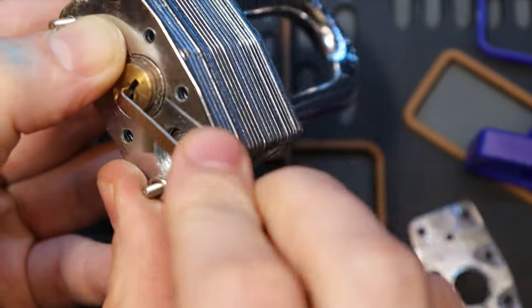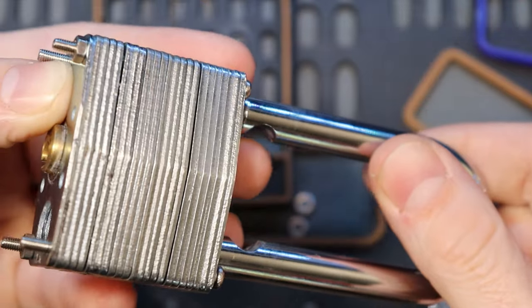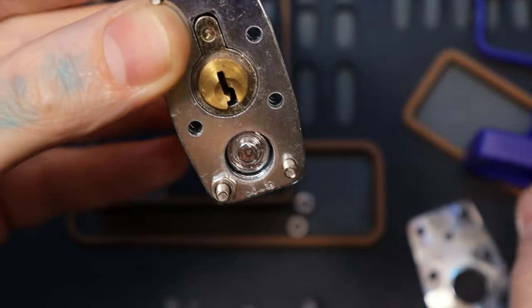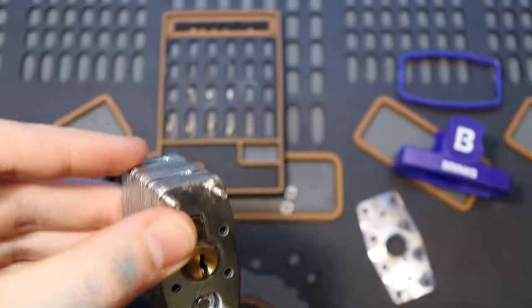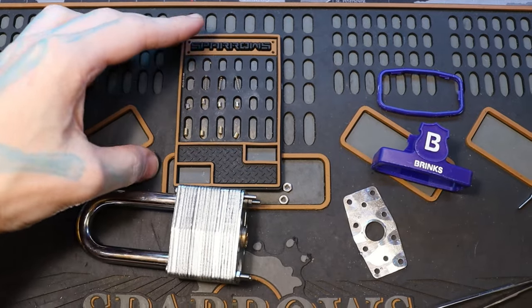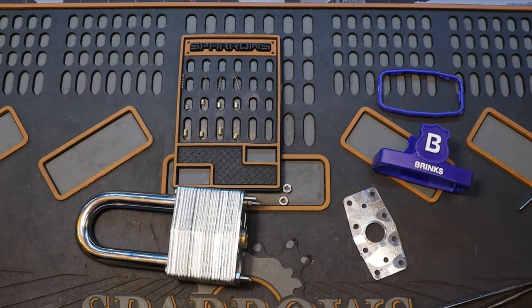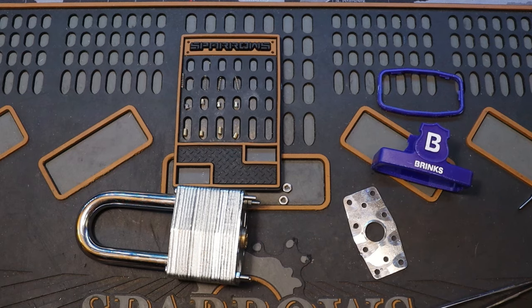There we go, now it's all the way back. We turn it and that releases our ball bearings. I shut it and it goes back. Really cool, really interesting to play with. I have not taken apart a laminate lock before. I think I might be doing this more often because I find it really helpful to see what's inside these lower belt locks — it helps you visualize what you're going at when picking. Oftentimes when you're trying to progress and move up in different locks, that's all it is: just having an idea of what's inside the lock. Anyways, hope you enjoyed. Thanks for watching.